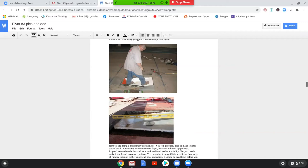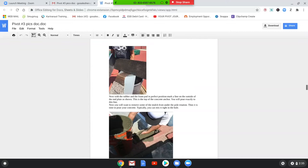It's important to step on the box — as shown in the top frame — to make sure it doesn't rock, just by stepping on it, packing it, and sometimes pulling the box off and smoothing the bottom by hand. You can see the black line on the top of the end plate — that's where the shredded mulch goes to when you're packing it down. Then you'll put an additional closed-cell cushion on top of that. Once you have the depth figured out, you're ready for concreting.